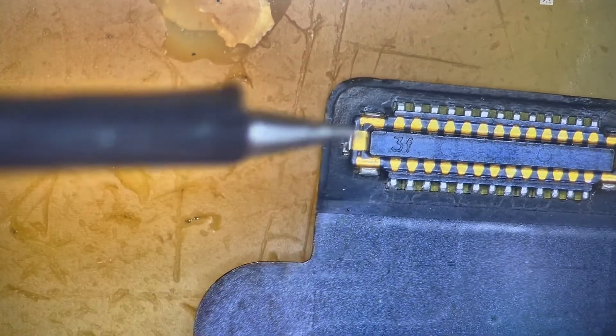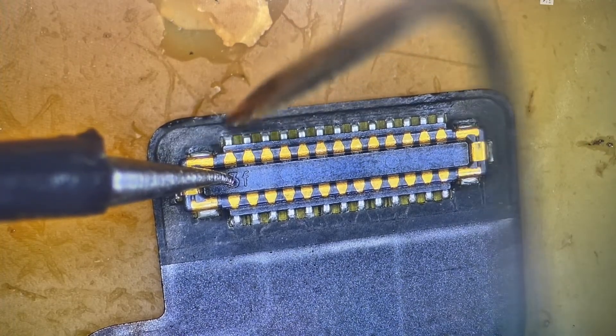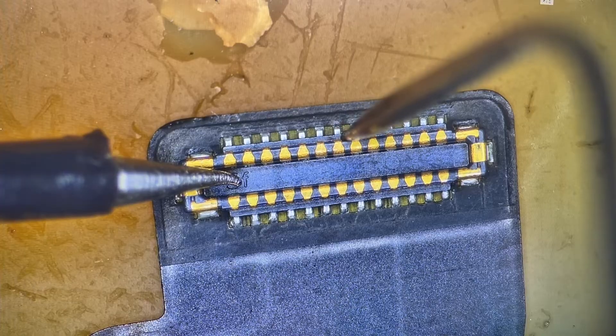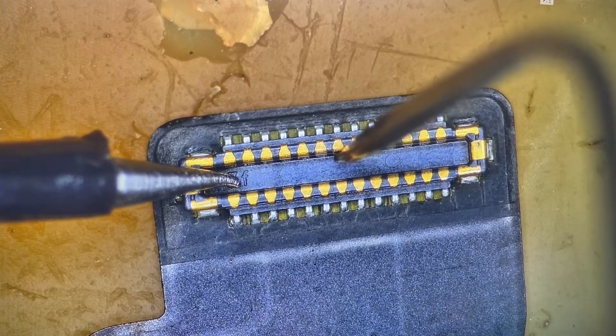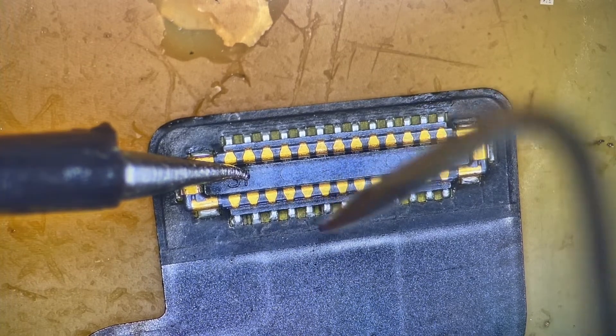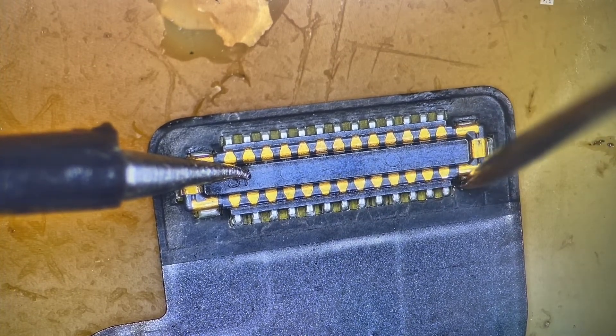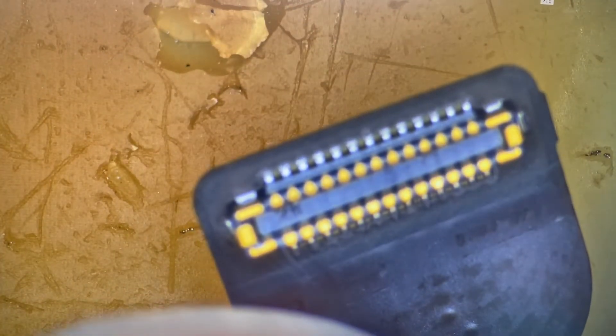Here I've got our replacement proximity sensor. When I go over here with my multimeter I'm on ground. This side's ground. It's kind of hard to see, but I can make out that the only one on this side that should be ground is this pin right here — the rest should not have any direct contact with ground, just this one. On this side, I can see all the lines coming off and nothing looks connected to ground. There are no schematics for this yet, at least on ZXW. So this will be a little interesting to diagnose. Let's go to our faulty proximity sensor now.